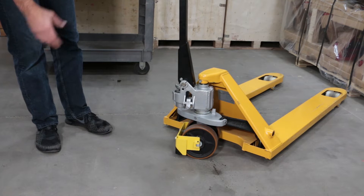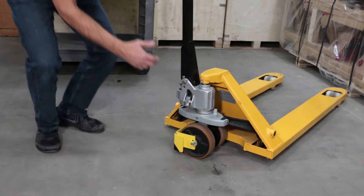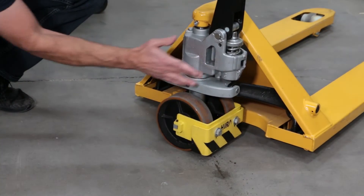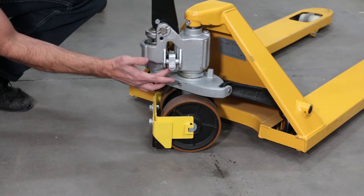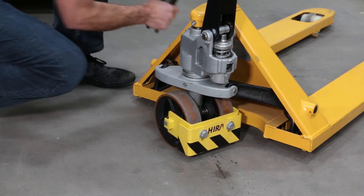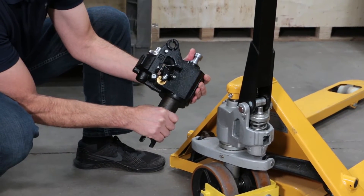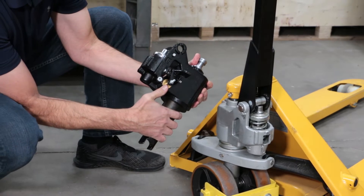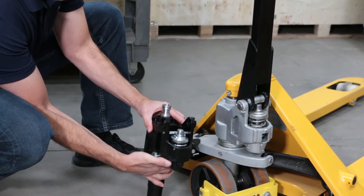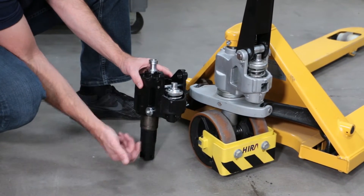The easiest way to identify your AC series hydraulic unit is: the AC pump has no plug on the left side, so you can see the valve is strictly on the right side. Alternately, the DF or BF pump has the valve on the right side and also has a valve plug on the left side, which means the valve flows completely through the pump, and it has a two-piece valve setup.